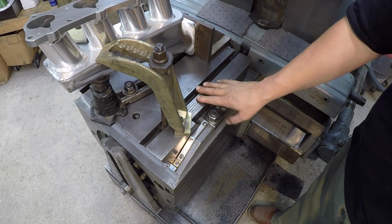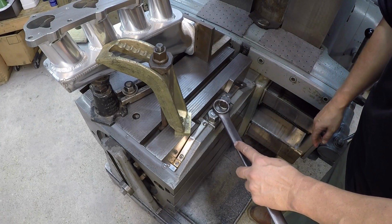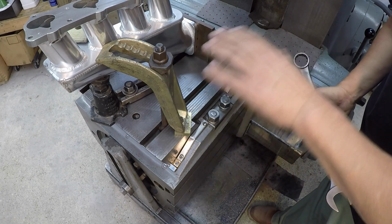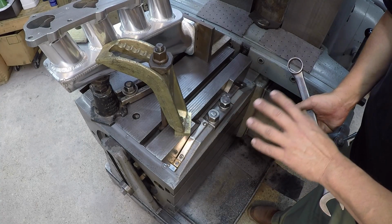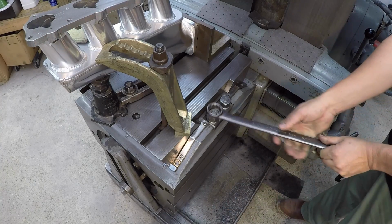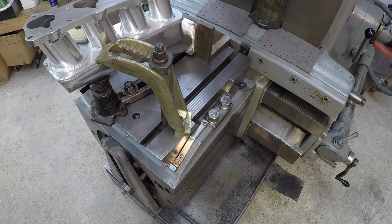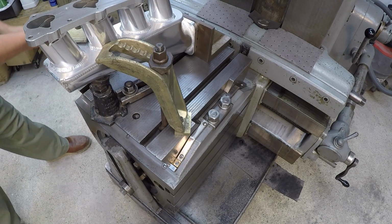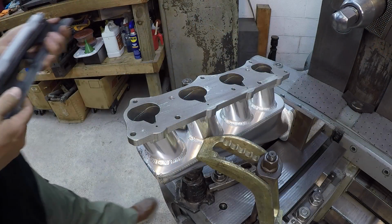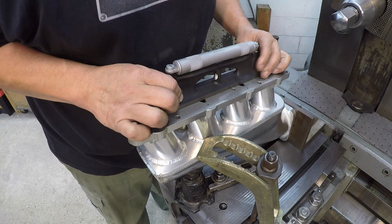This is the clamp that holds the table there from tilting. We got one on the other side, so we're going to go ahead and loosen these up. We'll stick a level up here on the flange face and just kind of eyeball it with a level to get it straight, and then we'll start indicating it. We'll use my Lufkin 58 precision level here on the flange face.